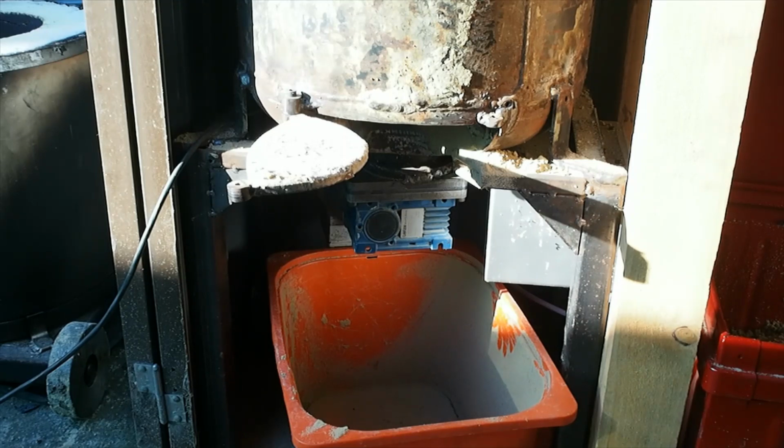You know, when you come straight off an iron casting especially, the sand can be so hot you can't put it in anything plastic, you can't put it on a sheet to stomp mull it. It needs to cool down. This way I can just dump it straight into the muller, and everything inside the muller is iron, nothing's going to happen to it. Put in a bit of water, run it, mull it. By the time the sand's finished, it's much cooler.